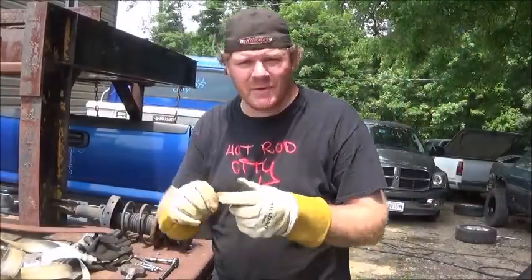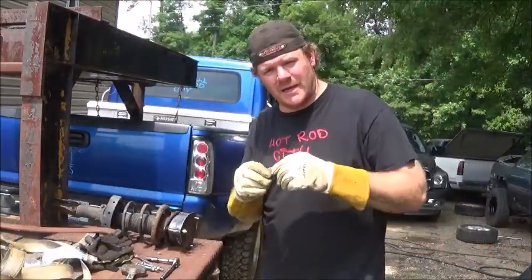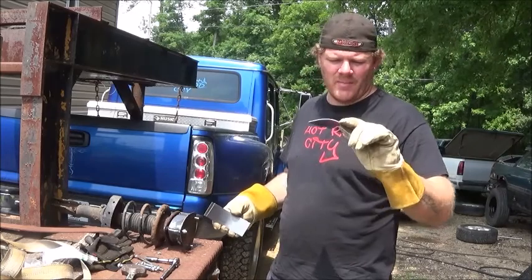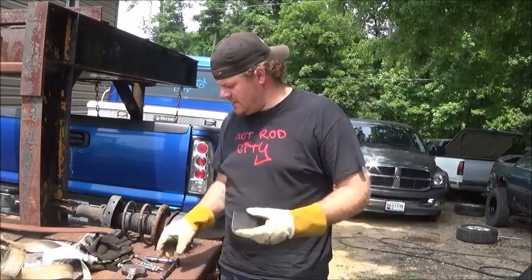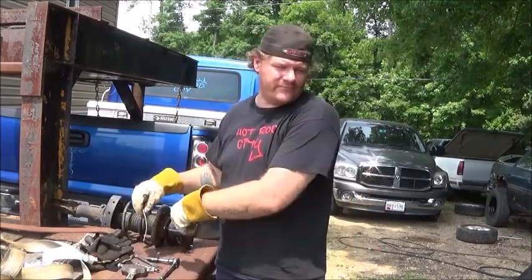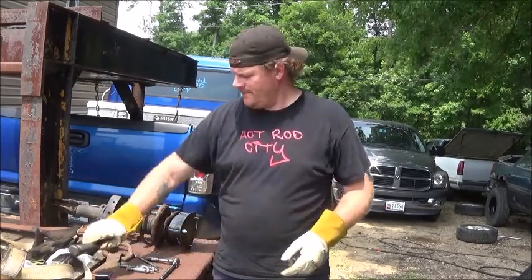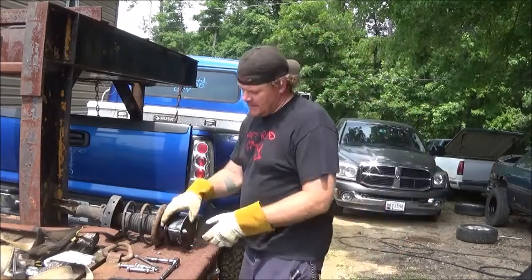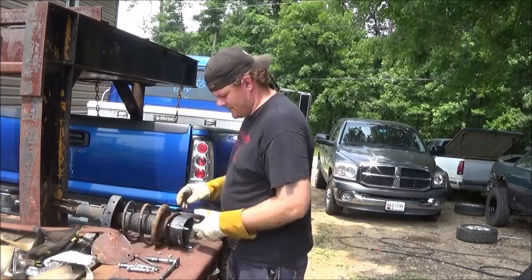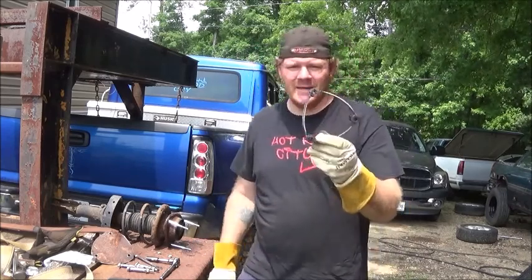Alright, we've got our top plate — a jig plate, I guess we could call it. Had to come back from the hardware store, but we got all our hardware. I took one of the pieces so I can cut it. After I welded these up — the large washers and the little spacers — I took and cut these pieces. It's just a two inch flat bar because the actual spacers are cut two and a quarter. So you put them on there, put them on the tie-down hook that's on the trailer, beat it with a hammer, bend them around to clear. Then I TIG welded that all together, and this is what it left me with.